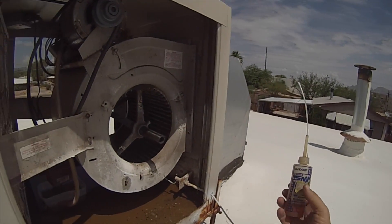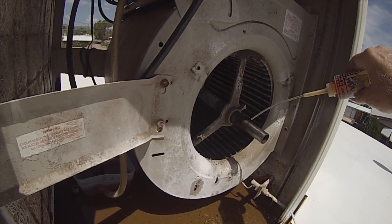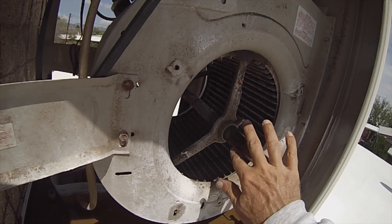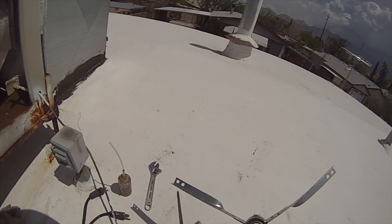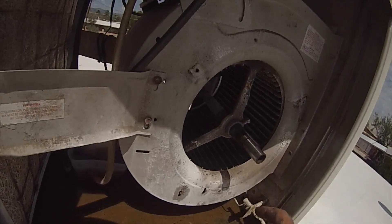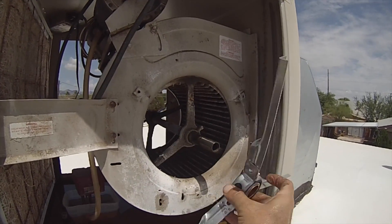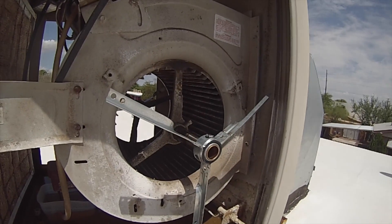I've got some of my Zoom Spout oil. This shaft was pretty oily, so since it was oiled before, I'm going to put a little oil on there. Once I take that bearing, put it back on, and fill it up with oil, all that oil is going to go around that shaft anyway, so I might as well put a little oil on there for lubrication before I put everything back on. I'm going to slip the bearing over the shaft. Now of course, you want to make sure that the oil fill is on top — it might be a disaster to put the whole thing together with it opposite and then have to take it all apart.